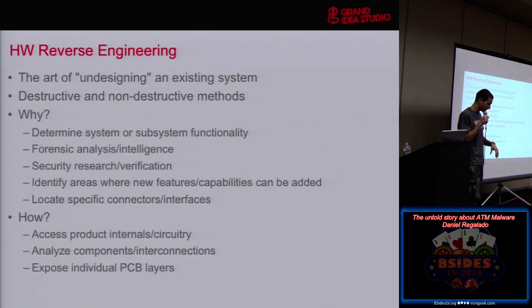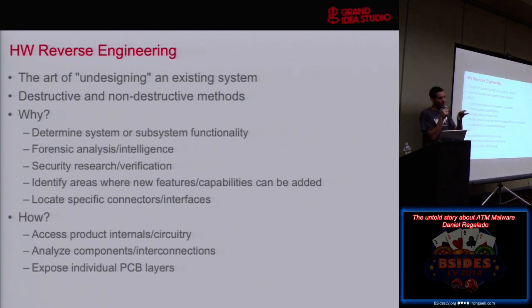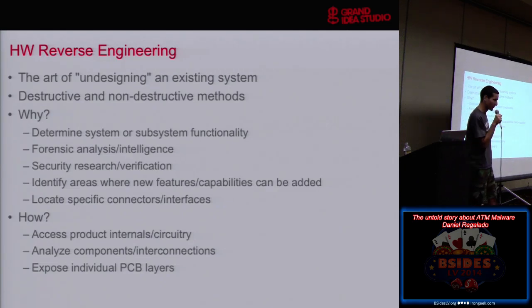There's lots of other work on my website, lots of presentations about the hardware hacking process and how to go through and analyze devices, reverse engineering, and stuff like that. The main reasons: maybe you want to figure out how a system or product works; maybe you want to find a particular connector on the board like a JTAG interface or a console serial TTL-level serial output used for a root console or debug output; maybe forensic analysis; looking at a board to make sure it hasn't been tampered with; or figuring out how it works to find a way to inject extra functionality — malicious functionality — sort of like our friends at the NSA have been doing for a long time and probably other governments as well.